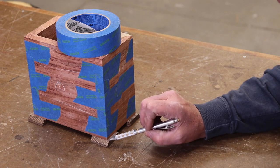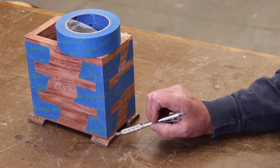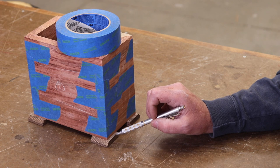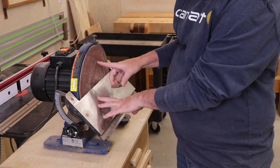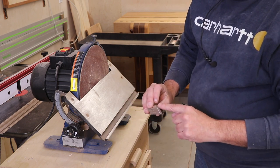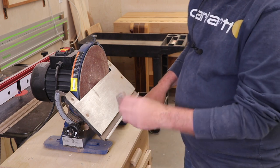I hope this is showing up well. I have the chamfer that I just did at the router table right here, and I need to do the short side now. For me, this is just too dangerous at the router table with this little tiny part, so I'm going to do it by hand — I'm just going to scribe a line on there and use a little rasp and some sanding to get that chamfer on. Actually, I changed my mind — I'm going to use my disc sander for this. I marked the line back to give me something to work to and carried my lines over on the ends so I can see where I need to go, and I'll do a little hand sanding after.